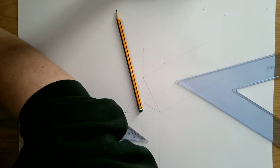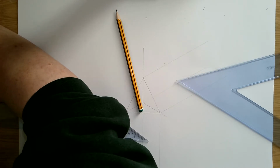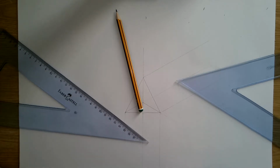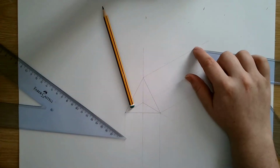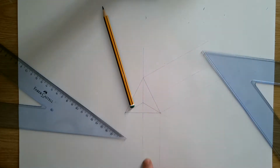Okay, so the question that you had for your exam, this is the solution to it. A couple of things you need to point out first of all. I may or may not be nice enough to point them out before the exam starts. At the end here on the drawing they give you, they point out that it has to be 120 millimeters long. That is important because when you come back up here and follow the widths of the trace, and you come back up here, the corner point there is the direct reference back to that 120. So that's how you're going to get your height up in the elevation.